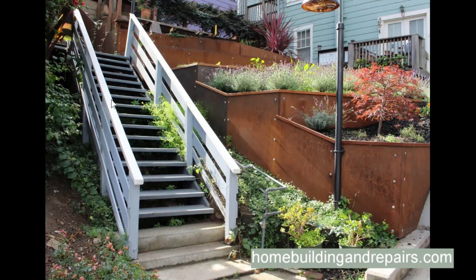Anyway, I hope this gives you an idea of how to build a stairway like this. These posts are an excellent way to build it. You can see here — if you had wood damage, you could actually just cut it out and replace just one section. Same thing with the stringer — if the upper section is perfectly fine, just remove the damaged section and replace it. For this stairway right here, you're probably going to have to replace this one because I can see the dirt right up against it. Big no-no.